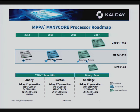And we got a chip back from the TSMC fab in early June this year, and it's still in the bring up phase, but so far so good. We use the TSMC 28 nanometer HP. We didn't move to HPM, for instance, because we kept the same analog IPs.